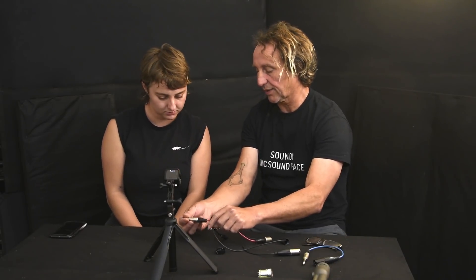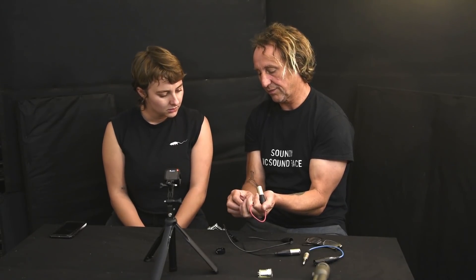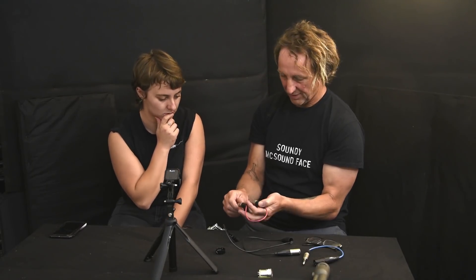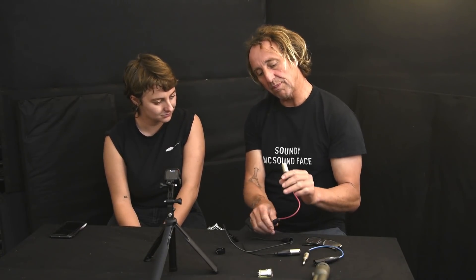Part of the reason old mics used to — not all conductors from connectors or cables for mics are 3 conductors. Old mics used to use just a standard 2-pin, like a regular quarter-inch jack. You can convert from one to the other by tying pin 3 to shield. So this is grounded — pin 2, pin 1, and pin 3 — but pin 3 is tied to ground. And with that, the ground just is not oriented as a separate conductor. That makes an unbalanced cable.